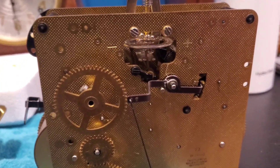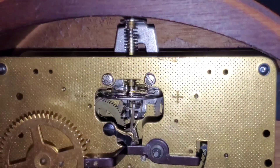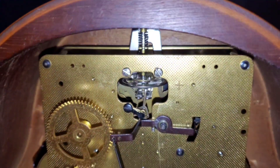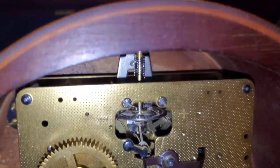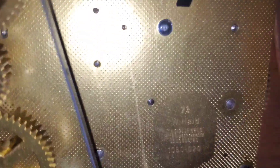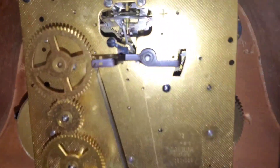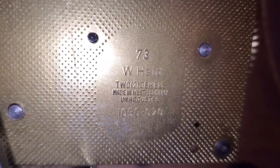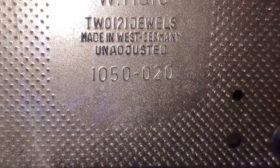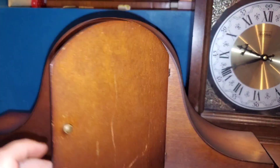This new one also floats a lot better. So I'm going to put it back in now. The new balance wheel is in. Now I'm going to see about timing it. Hopefully it had to do with the balance wheel being bad and not this bushing job that is just waiting to have to happen. Hopefully this will hold out the W Haid movement until I have the funds for a 1051-020 with a 15 centimeter pendulum, because screw balance wheels — too much of a hassle.